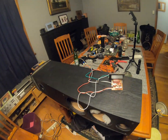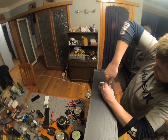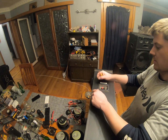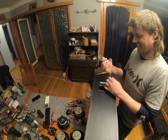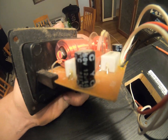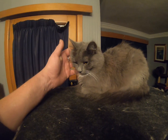But it's weird because I'm getting the same impedance reading on that speaker. So do they both have the same bad capacitor problem on their crossovers? Let's see. Hello. Yep. Bloody perfect. Come here and go for it. So same capacitor, top of it bulging. Other side, which will be the low end pass, sweet as. What can I do, little spot? What can I do?